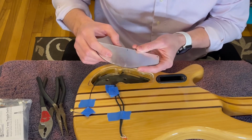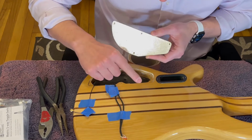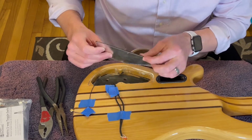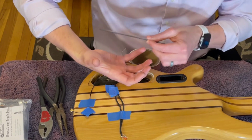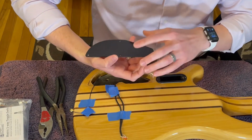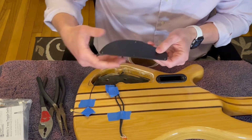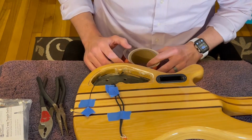I think this looks like aluminum. But by coating this, if I bring up my edge of the copper tape here, when I put this back on, it'll smush down and that copper will contact. So not only can I have a bottom cage that's protecting, when this goes on top, it actually completes the cage so that once I wire a ground wire there, the entire cavity can be a little more protected from external interference.